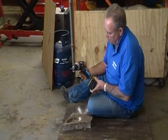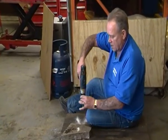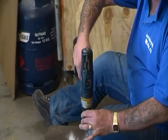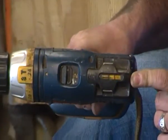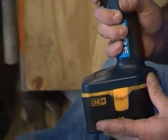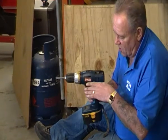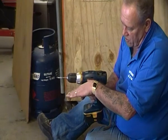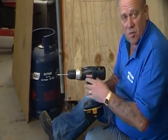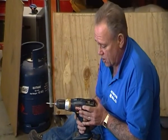That's how a combination drill driver works. Apart from the spirit level on the end so that we know the drill is going through vertically, it's also got a horizontal level on here. That allows each screw to go in horizontally, which makes putting shelf brackets up much easier — because if one screw hole goes in at an angle and the other goes in at a different angle, getting those two brackets level becomes much more difficult. Just like everything else in the building industry, it's the attention to detail and preparation that is the difference between a good job and a bad job.